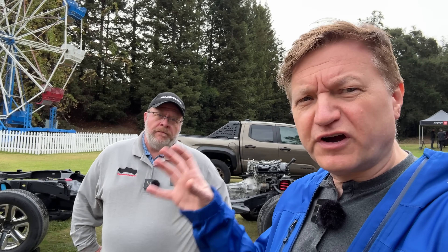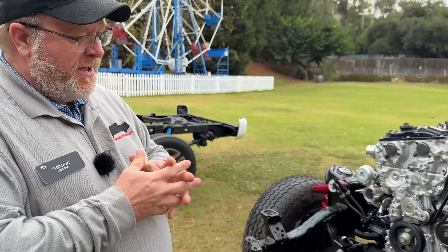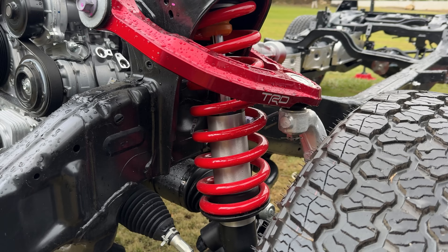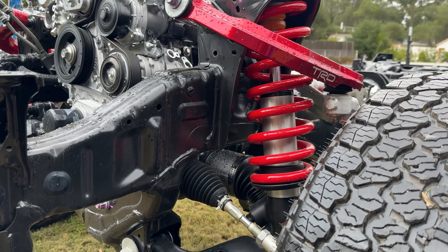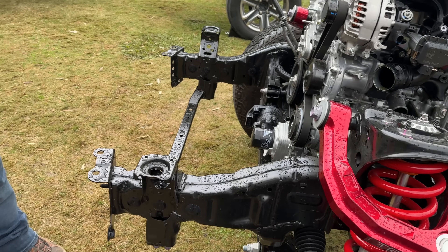With the different grades, as we move from on-road to off-road, you've got different types of suspension. We have a slightly abnormal rolling chassis here. In the front we've demonstrated what the TRD Pro suspension looks like, and in the back we have the TRD Off-Road package suspension. You can see there are some unique features: we have the forged aluminum upper control arm and the Fox QS3 switchable system for the Pro.